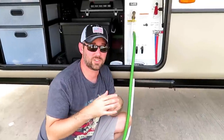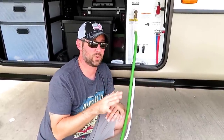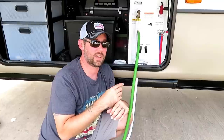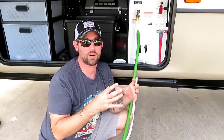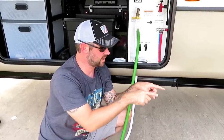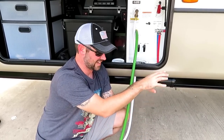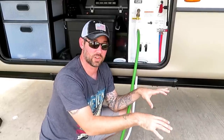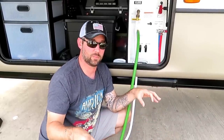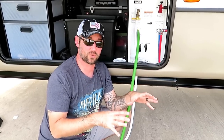Now, I mentioned earlier that last night I closed the gray tank, which we normally leave open. I closed it last night and I collected our shower water that we took showers with and stuff. The reason that I did that is because when you dump your tank, sometimes in this hose there's some residual stuff still inside the hose that the pressure we built up from the black tank doesn't push out. But the gray tank collects enough water that it's going to really shoot some pressure through there to knock all that residue out through that hose.